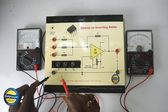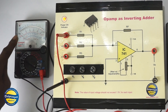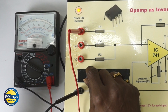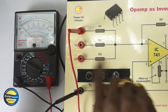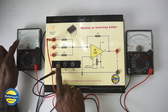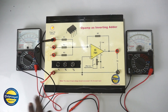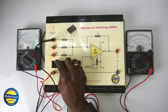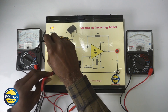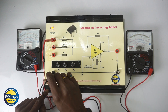I set this voltmeter at V1 and switch on the circuit. You can see the needle is deflecting in an anticlockwise direction because the voltage right now is a negative input voltage. If you want to make it positive you have to rotate the knob clockwise. If you rotate it anticlockwise, the reading will be on the negative scale. To measure a negative reading you can change the polarities of the voltmeter. The ground line is here.